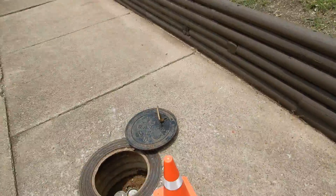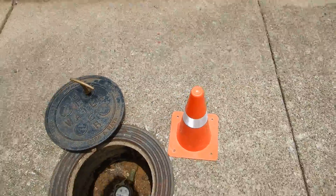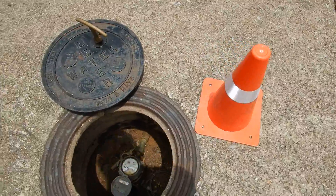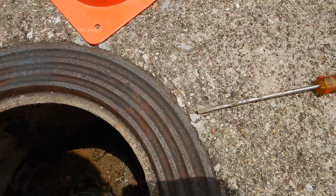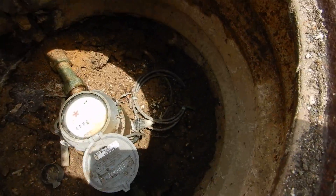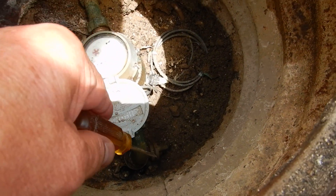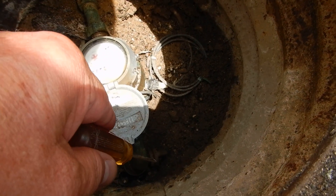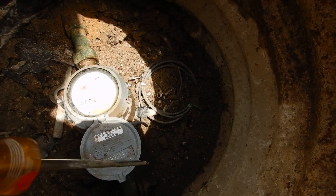This part is. In the parkway sidewalk, this is an analog meter. If we look inside of here, what we notice is that's the city's valve right there — or the water company's valve, the utility valve. Parallel is on, perpendicular is off. It's on. You shouldn't have to deal with that normally.